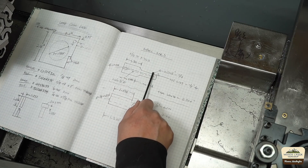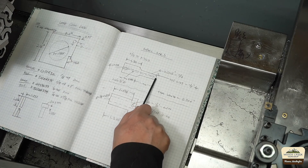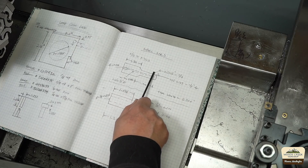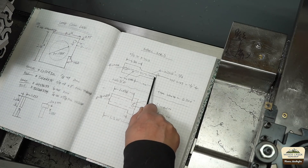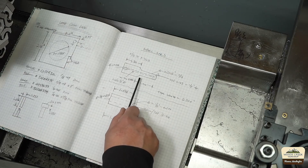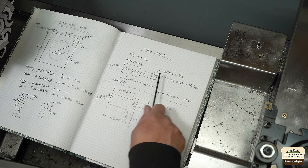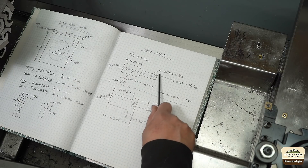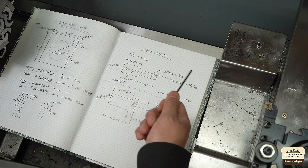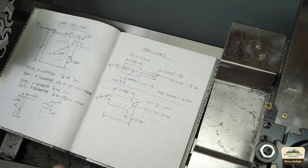So what we're gonna do is just take this down to the 5/16 inch diameter just maybe like half an inch or so, and keep this at half inch all the way here, and then we'll drill and come back to the lathe and finish dimensioning. I'm just afraid that if we dimension this diameter all the way, we may not get the 45 degrees here. I could be worrying too much. Probably am. I think that's what we're gonna do. We'll see.